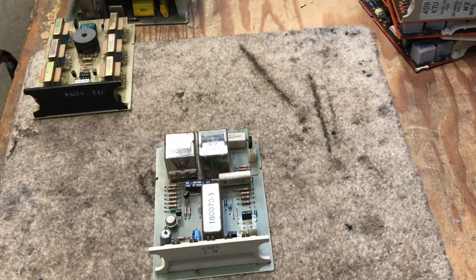I never worked on any of that stuff with music on hold. We always used ITT or occasional Stromberg Carlson equipment, and music on hold was not that big of a selling feature due to the cost. On a lot of 1A2 systems that had music on hold, it may not work very well due to the size of the key system and the way it was installed. The more telephones and the more cable, the more noise introduced into the phone lines — they would pick up the interrupter and ground or inductive noise in the background.